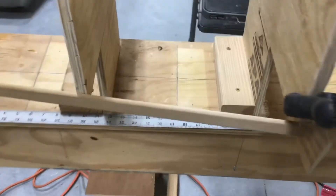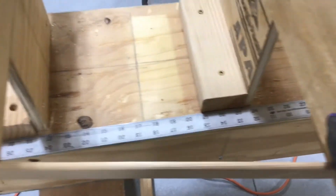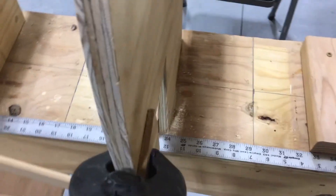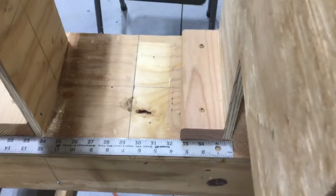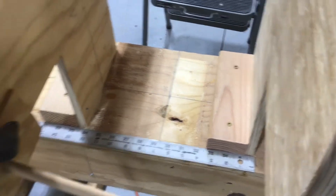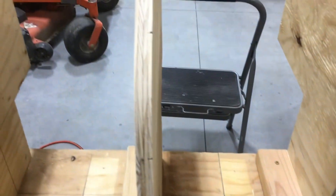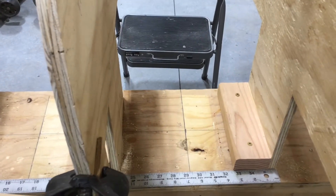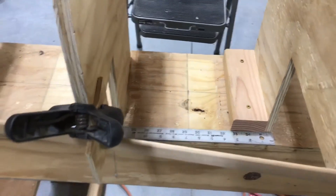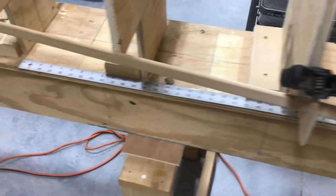I know that I'm 12 inches in between stations. So you can see there we go from 12 up to 24 - the front facing of that one's right at the end of the yardstick at 36. But because of the fact that the plywood's five-eighths thick, I've got to subtract five-eighths off a foot, and so I should have 11 inches and three-eighths in between pieces of plywood.